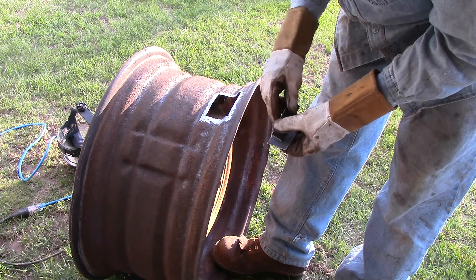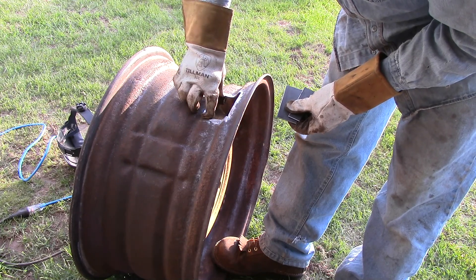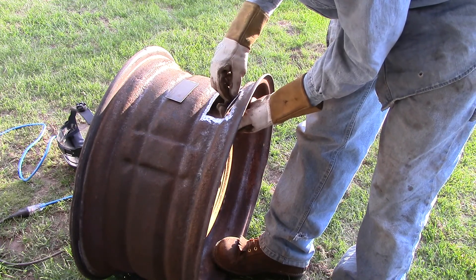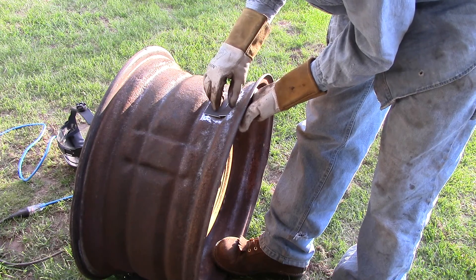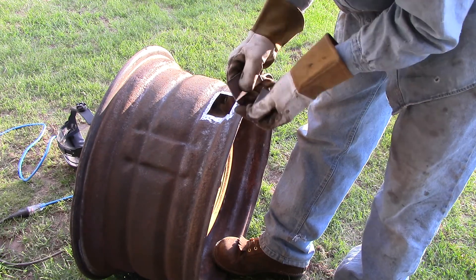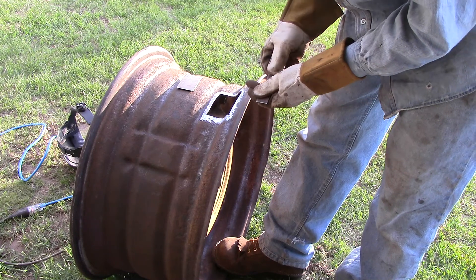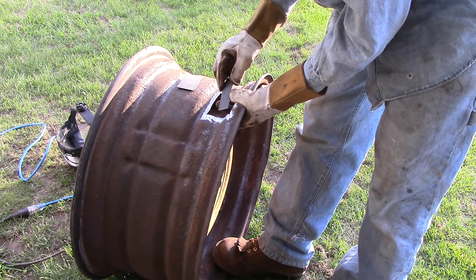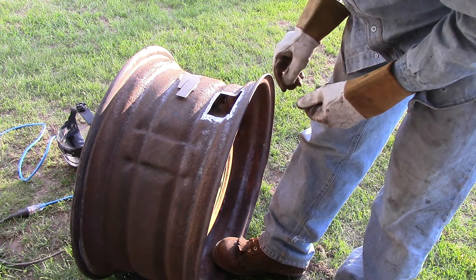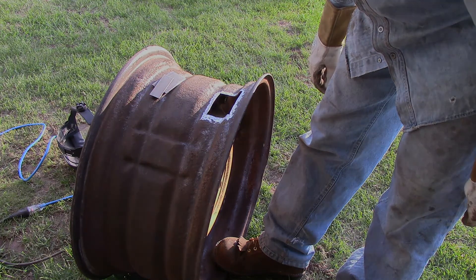On the outside section I cut two pieces of metal out of 14-gauge steel. I needed one piece at one and three-quarter inches by three and three-quarter inches, and one piece at one inch wide by three and three-quarter inches. These will basically go in here and be fed up to lay inside. Right now I've got them cut a little bit long because I'm going to have to roll them a little bit to make the radius of this wheel. Whatever you do, don't cut them short — if you cut them short you're going to have to do it over again.